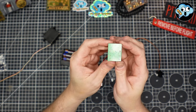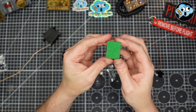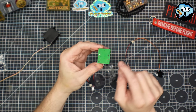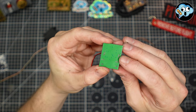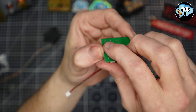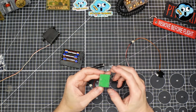Look at the back of your circuit boards, and these through connectors will have little solder blobs on them to connect them to multiple layers of the circuit boards. You want to make sure they're all separate blobs, individual blobs. If you're testing something that's not working, but you look at the circuit board and these blobs ever touch together. These are really close and kind of hard to see, but they just don't touch. These don't touch. Those don't touch. But they're very close. Put on your little magnifiers like an old man like I do, and just look at it.